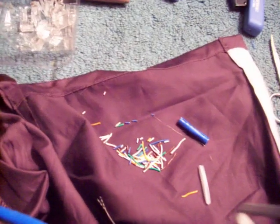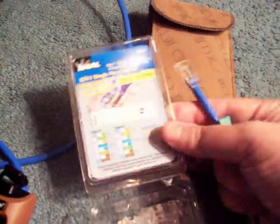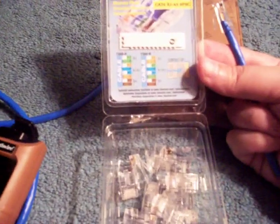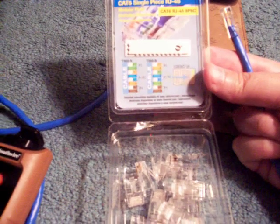It's really not that complicated, I'm just struggling a bit. But I have — as you may or may not have seen before, you probably can't because it's out of focus — I have put the cables in order: white, orange, orange, white, green, blue, white, blue, green, white, brown, brown. I shoved them in there.